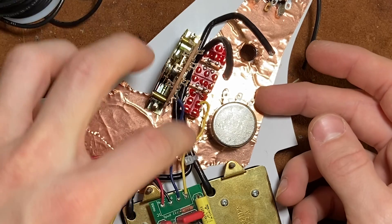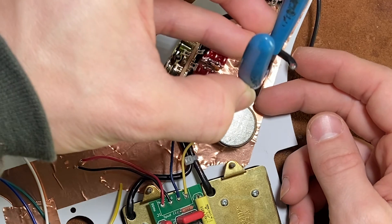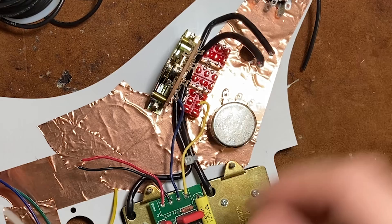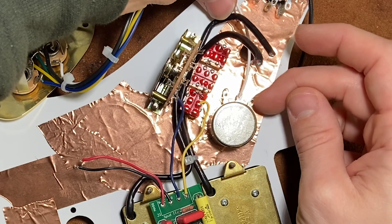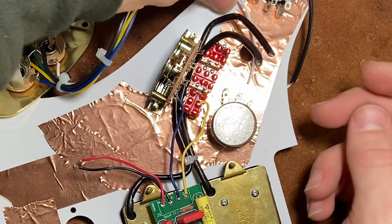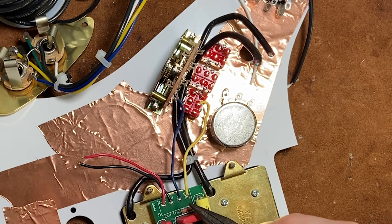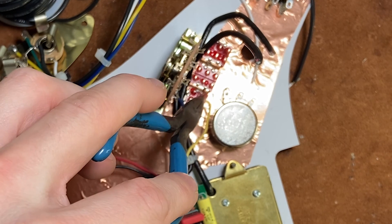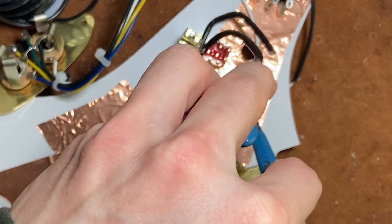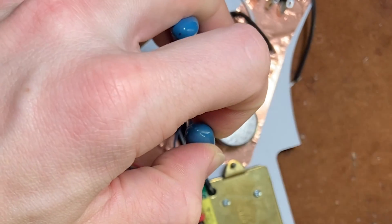You need to get the other side of this oval bypass switch to your volume pot, and from your volume pot you're going to take your pre-wired oval jack and connect white — so there will be a white wire from here to the other side of that oval jack — white straight to your output. Let's follow the signal: it comes from your pickups, goes into your switch, goes out of your switch into the buffer, goes out of the buffer into this side. Now what's it doing? If the switch is set to pass the signal through the volume pot, it goes via the invisible white wire to the white of your output and then to your amp. If the switch wasn't set that way, there's nowhere for the signal to go — it kills the signal.